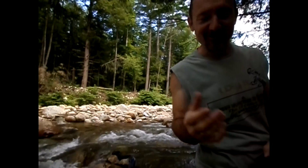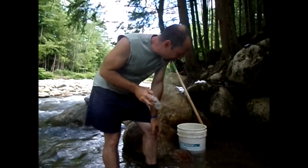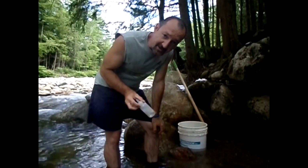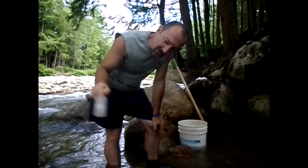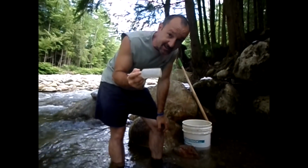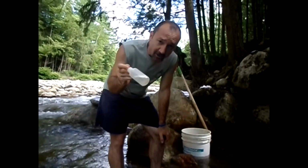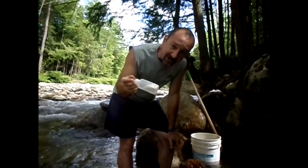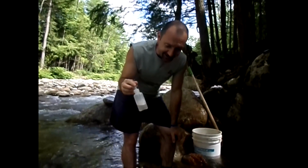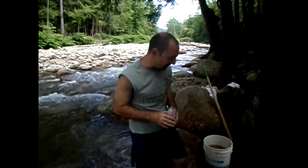Jerry's going like this, he wants me to give it to him. We've classified a bucket of material here, about 3/4 of a bucket of material. So I'm going to put this gold inside that bucket so you can see exactly what's going on. You can see that it's keeping that small gold. The gold that is in here is everything under 20 mesh. It's everything that would go through a 20 mesh classifier, which I think is a good indicator because it's going to keep bigger gold. What you want to see is if it's going to keep the smaller gold. Then you know it's going to work.